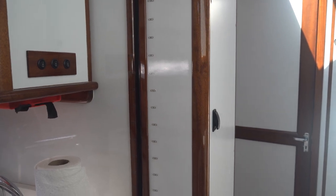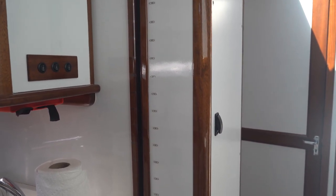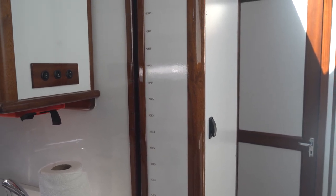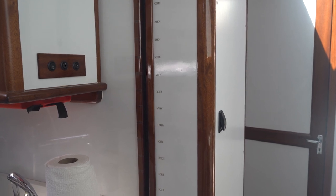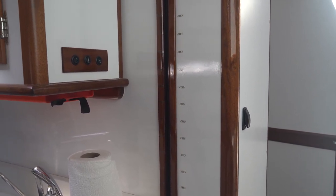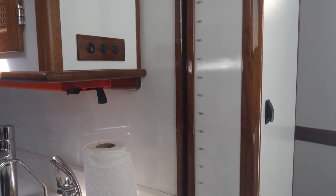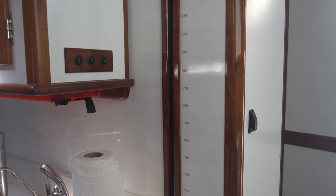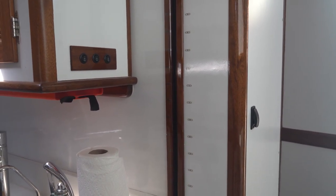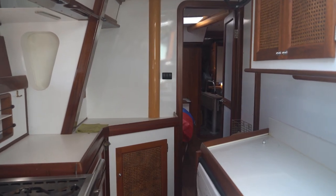One cool feature about the day tank system: the fuel pickups are tiered. The top pickup is for the heater — least critical, it'll cut out first — followed by the generator. The bottom pickup is for the main engine. A nice redundancy safety system for fuel management. There's also a sediment cup with drain to drain out dirt and water. The fuel manifold lets you choose which tank to draw from to fill the day tank — port or starboard. There's also a fuel polishing system on board with Racor and an LGX system. You can also balance the tanks.